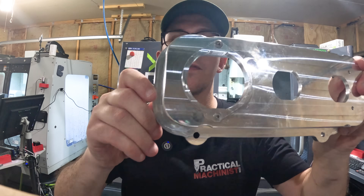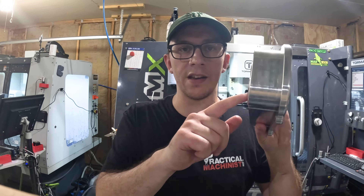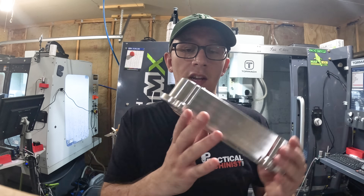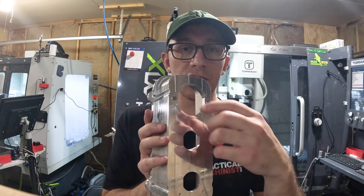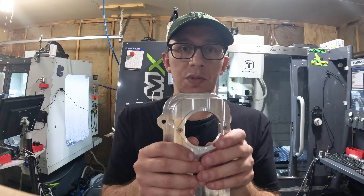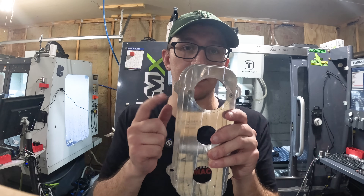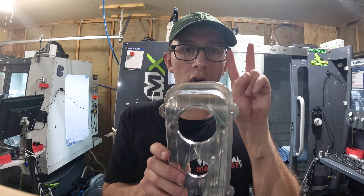This is the sleeved item — we'll do a close-up in a second. So what we did was we machined an item — it's a two-operation product. We machined a blank, then flipped it into the round surface that fits in here. We re-machined all of these and added two tapped holes to avoid any rotation and to hold it in. Then we actually shrink-fit these — the sleeve gets thrown in the freezer, shrinks up, and we press them into this piece, then bolt them in. We let everything grow together so that it's all one piece.